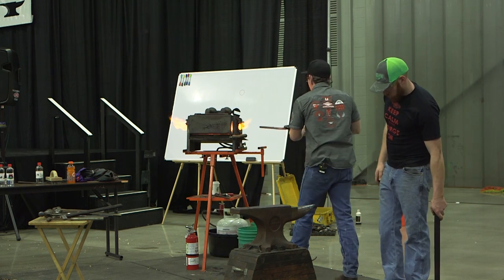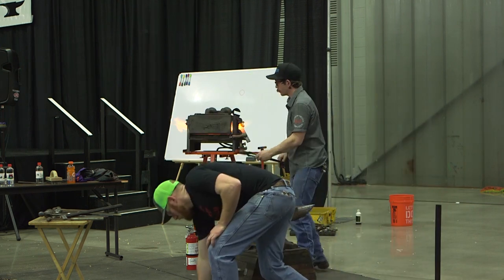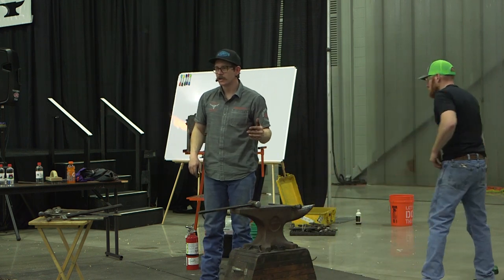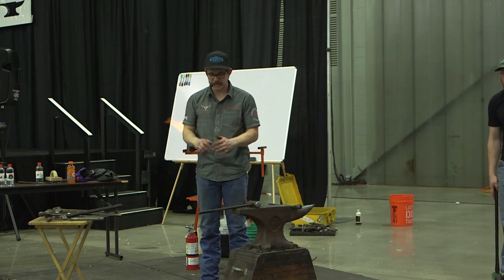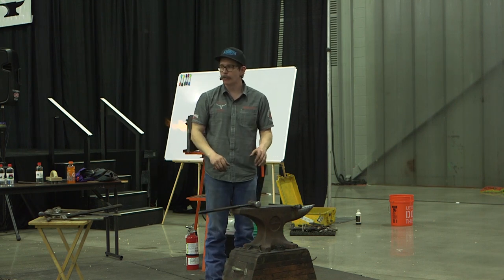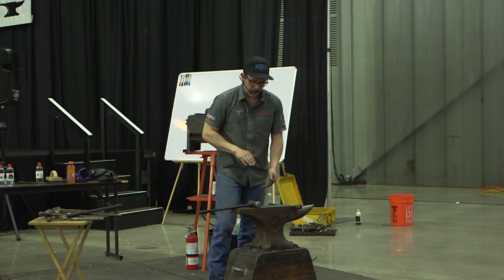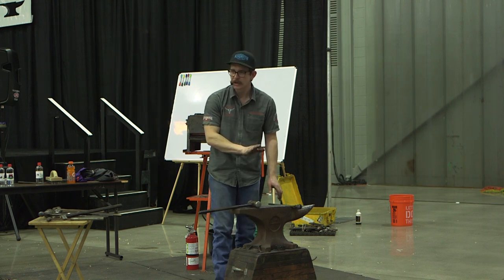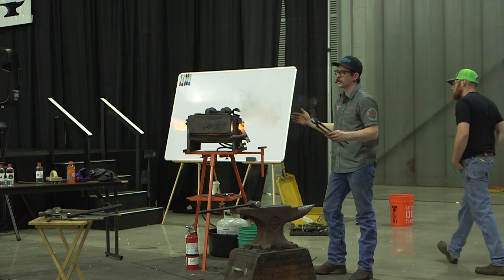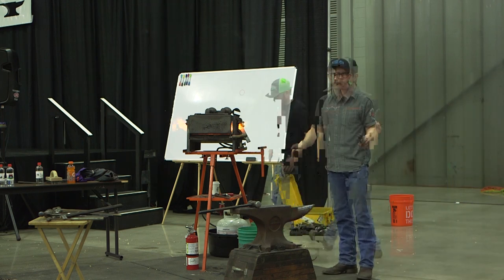The reason I wanted to do a draft horse shoe, mostly, is because what we did in the shoulders of the tongs is the same thing. It's a total off-the-anvil blow to create a shoulder, and then you come back to it from behind it. But I think it's a good comparison of where blacksmithing really falls into our work all the time.